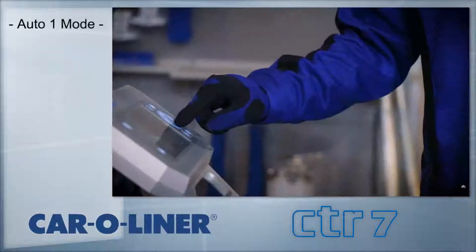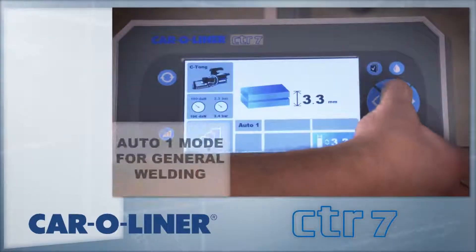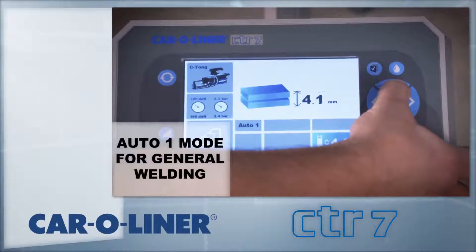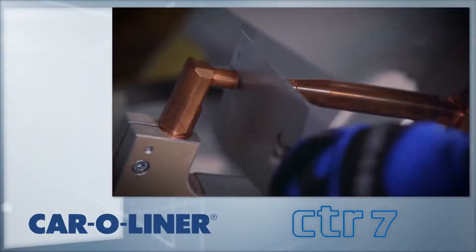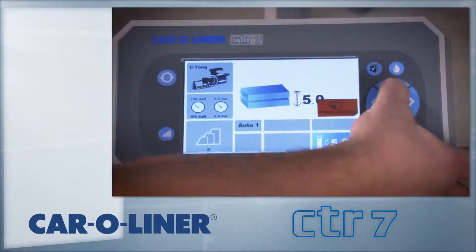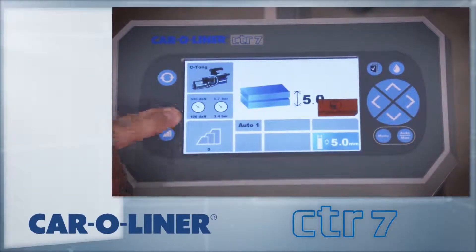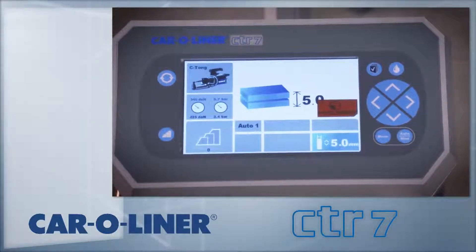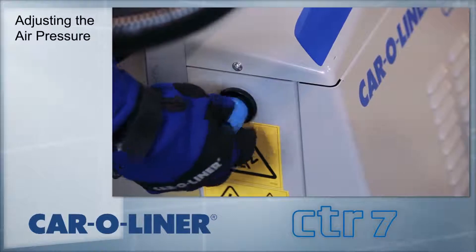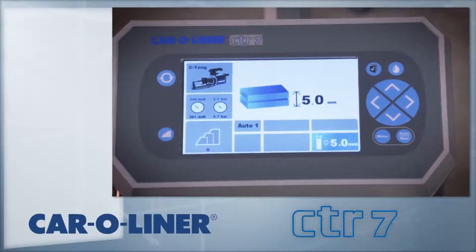Several modes for welding are available. The Auto-1 option allows for welding as determined by the total thickness. Pressing the up or down arrow, the technician sets the combined thickness of all the layers, and the welder will automatically set the parameters needed to make the weld. When welding material thicker than 5 millimeters, the welder will provide notification that the air pressure must be adjusted. Air pressure readings are displayed in the lower left corner of the screen. The top set of numbers display the required pressure, while the bottom numbers indicate the measured values. Turn the air pressure regulator up or down to adjust. When you are within range of the desired value, the message will disappear.